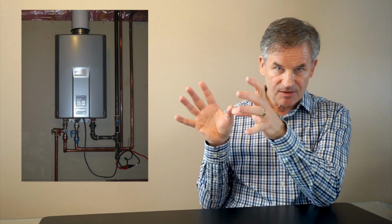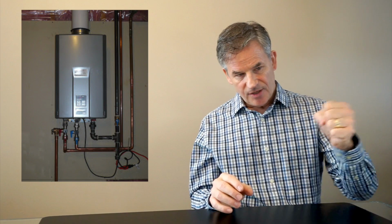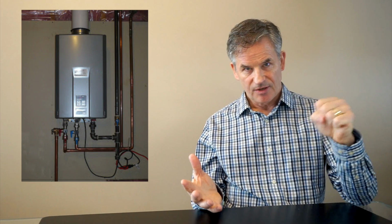Now, the other kind that's getting some traction is the demand system. That's the box that goes on the wall, and when you turn on your tap, a flame comes on and heats the water; you turn off the tap, it shuts off. Those are fabulous if you want a 3-day shower. You never run out of hot water. One of the issues is if you're doing dishes and you use just a little bit of hot water, turn it off, turn it on, turn it off, you won't get hot water, because you need to have a constant demand for the hot water to run through the lines. So some people don't like it for that reason.